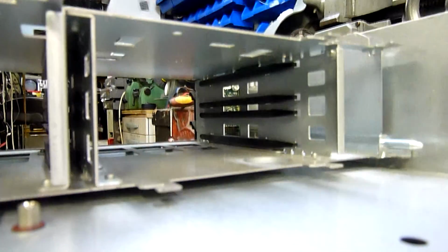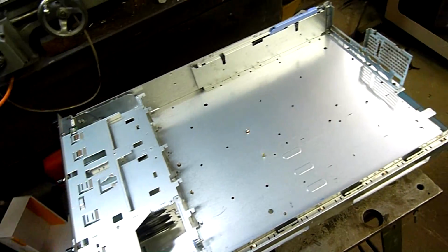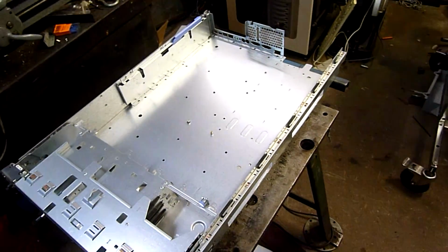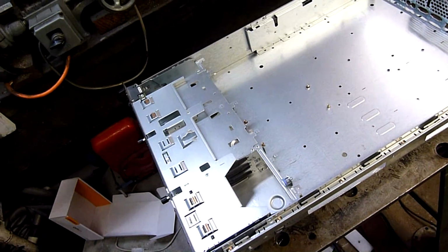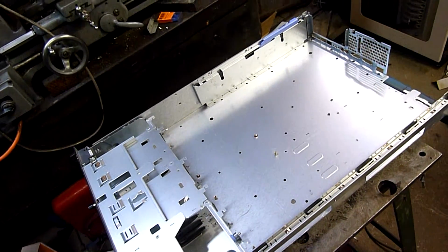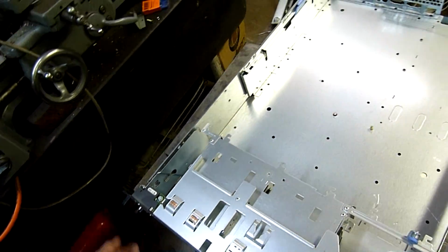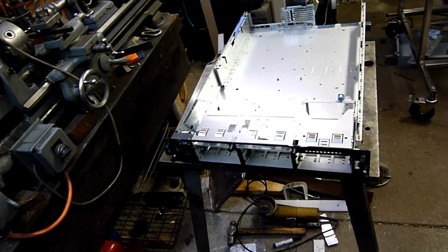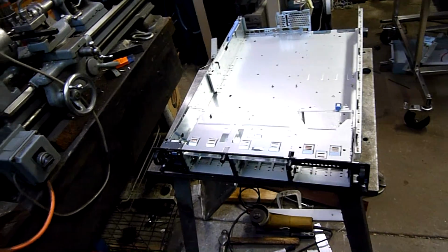Every panel gap opens and closes whenever you move it around, so that's not good in any computer case. If your case twists and buckles whenever you move it, you've got a really cheap, nasty case, and I have seen motherboards destroyed by that. So beware. Buy a reasonable case, or at least try and stiffen the one you've got, or just don't move it. Taking them to LAN parties when they're a flexible case, that's killed plenty of mainboards. And causes other issues like cards popping out of their slots partially, various glitches and things like that.